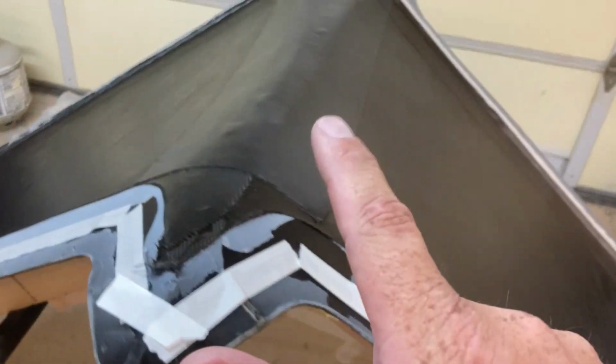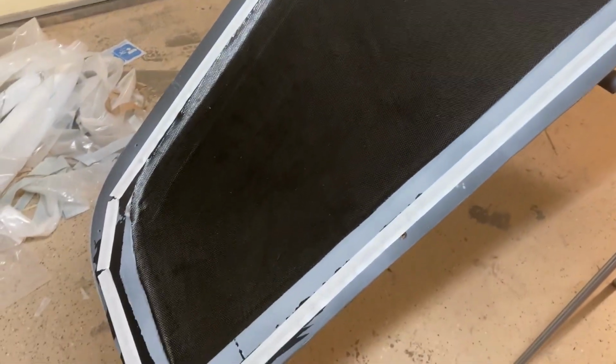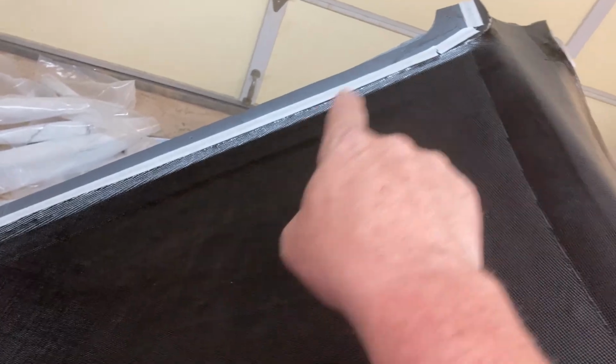I've got the outer skins down. So that's 3 plies down and a couple extra in the middle just for safety, or just to make me feel better. Not in the structural calculations, but I figure it can't hurt. So now what I'm gonna do is I'm gonna take my flush trim scissors and just trim back the leading edge just exactly as I can. That just gives me a little bit better chance at getting a real close mate, and I won't have to sand as much. So after that, the Kevlar hinge goes in.